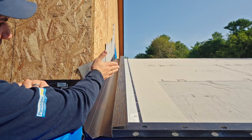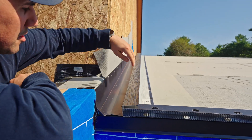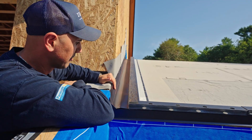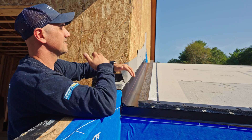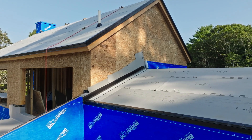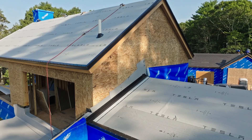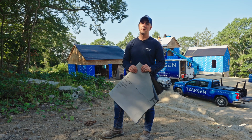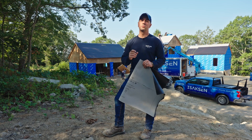Here's a good example: you can see the Tesla underlayment going up approximately eight inches, comes down onto the roof. On top of that we have what's called a sidewall flashing, which comes up about three inches and goes in approximately six inches. Overlapping that is the Tesla underlayment. Very easy on a new construction house, but on an existing home, this metal flashing is going to have to go up behind your siding — which can add costs, because in many situations some of the siding actually has to get physically removed to do the job right.